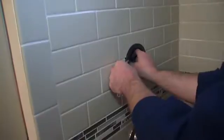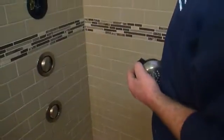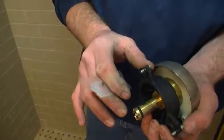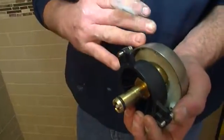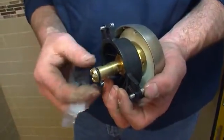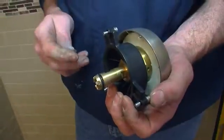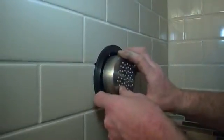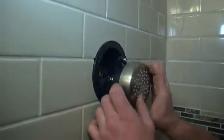the housing will move. Now it comes with this little cap to protect the O-ring, and your 3 mounting screws are actually right here. Moen provides the Allen wrench. They provide, like I say, once again, plenty of grease, and actually a spare O-ring in your box. Now this one was the interesting part, which I lined up.